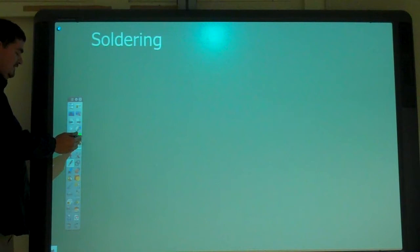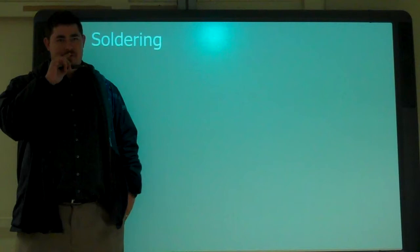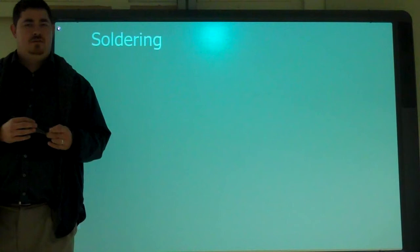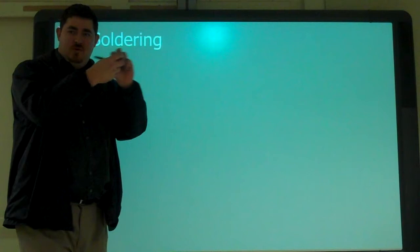It's not welding, right? What happens when you solder things? Just a temporary. You're using kind of a metal glue, right? If you think about wiring, you're bonding two wires together. But are you actually melting the wire? No, soldering, no, you're just melting that metal. You're melting the solder, and the solder flows around and kind of sticks to it and makes the connection.